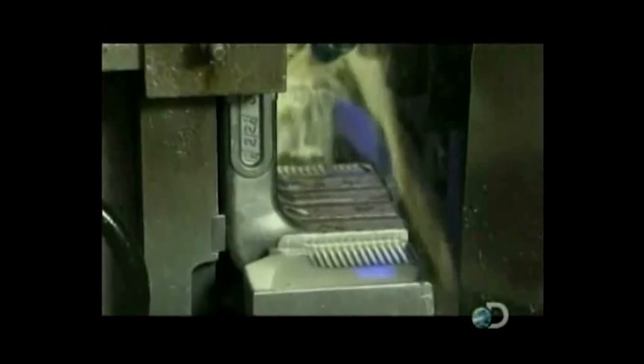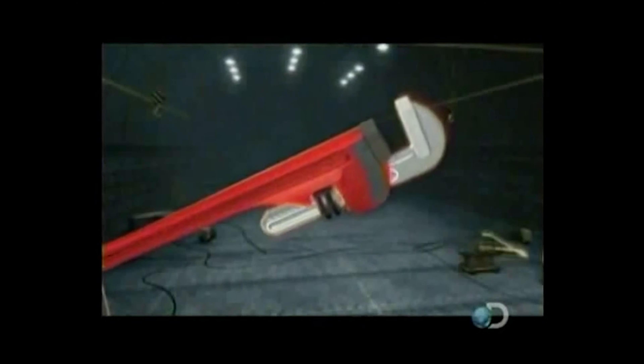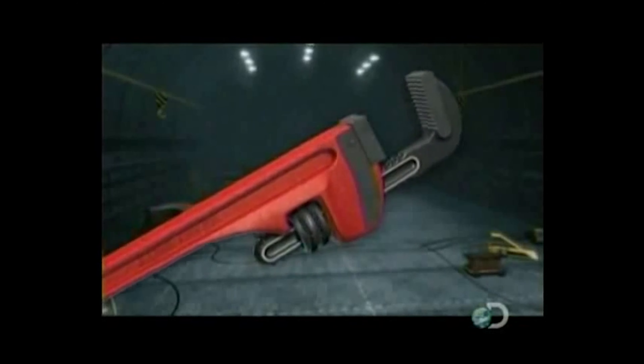When the molds are ready, a huge two-ton ladle transfers molten iron from the holding furnace into a pouring tank that pours it into the molds. It takes about 45 pounds of molten iron to cast the five wrench handles made by each mold. After they're filled, the sand molds pass through a cooling tunnel, then broken apart and dumped into a vibrator to shake the sand away. The seams left by the molds are ground away and the handles are finished with a coat of electrically charged auto body paint, which adheres to the metal like a magnet for a watertight seal.